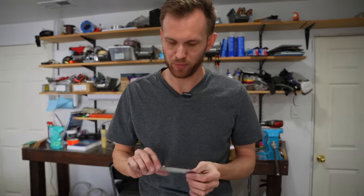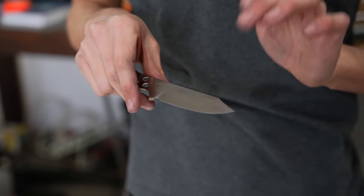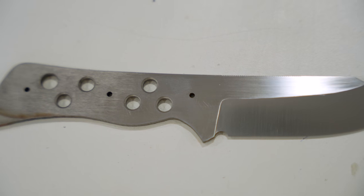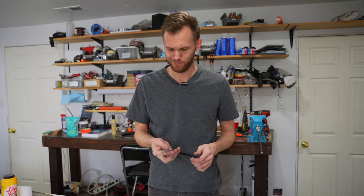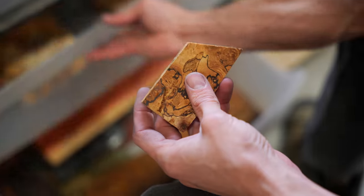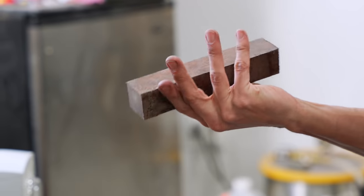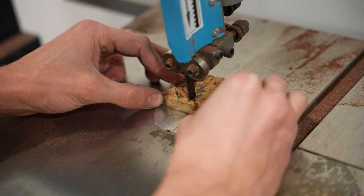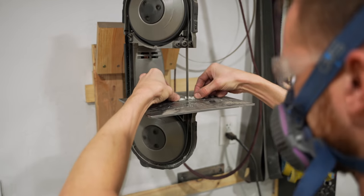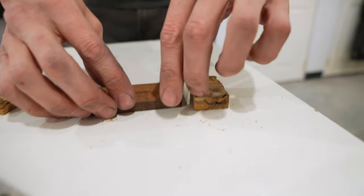I'm pretty happy with where the blade is. The bevels look good, the brush texture on the bevel looks good with the straight perpendicular lines on the back of the body. So it's time to move on to making a handle. First I've got to decide what materials I want to use. I have a bunch of options — let's take a look at some of them. I think I'll use this for the top bit, and I'll put a spacer made out of G10 — this nice warm brown color. I'm not sure exactly what it is but I like it, so we're gonna try it.